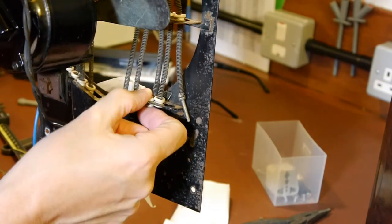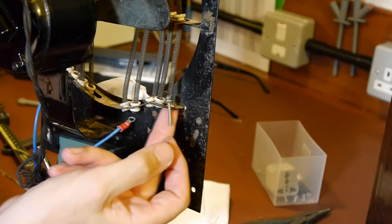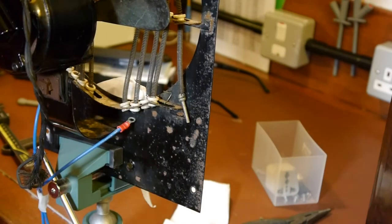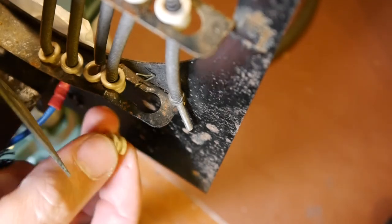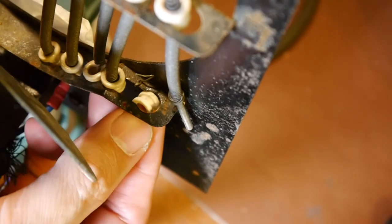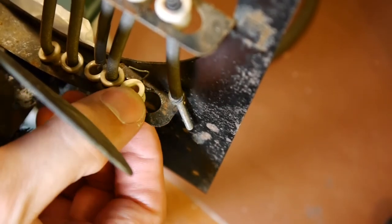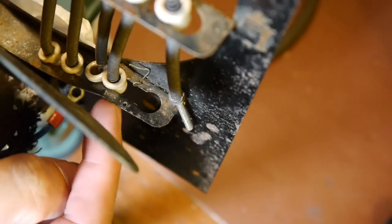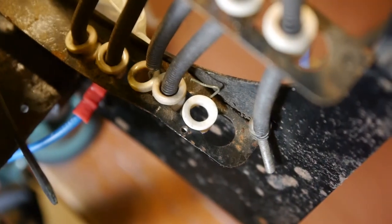Some of the dimensions really aren't that critical - as long as we can get the bolt through the center and get some insulation on either side of that bolt, it doesn't really matter exactly what type of ceramic insulator we end up with. I saw a few different varieties on eBay and some look fairly close. You can see the big hole that you have to feed the ceramic through - you push it through where the hole is widest, then slide it into the groove where it gets trapped. Then to stop it sliding back, there's that piece of wire which wraps around and goes through a hole in the frame. Hopefully that's obvious - I'm sure we're going to find something to fettle that.